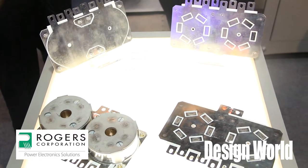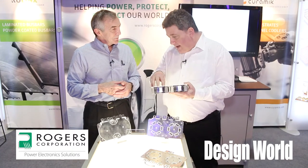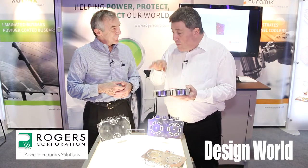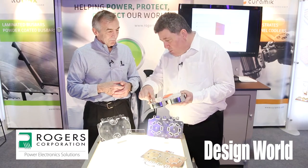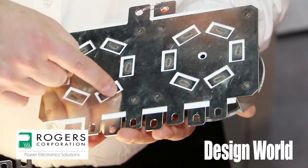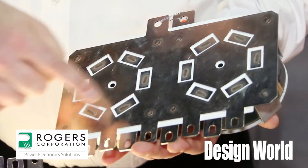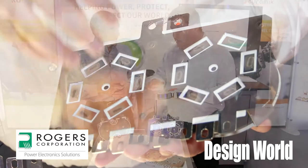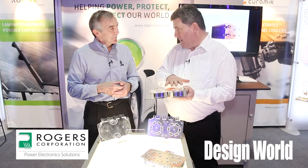So we signed up with a partnership with SBE, who's making these unique capacitor rings to connect them together and improve on this product from both ends. As you can see, this is a welding technology that goes directly to the capacitor winding, taking out all of the inductance in there, only leaving the inductance towards the tabs of the IGBT.